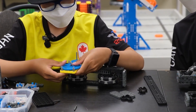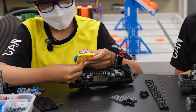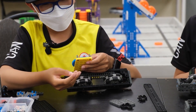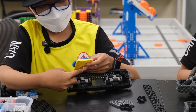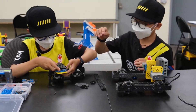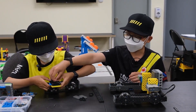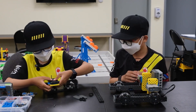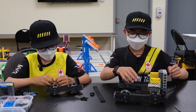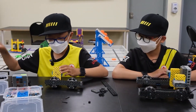For this build we are using the metal motor axles, but V1 comes with plastic ones. The plastic tends to break easier, that's why we got these metal ones instead. When you're done, the first thing we suggest is to change your plastic axles into metal ones because they're stronger. When you get heavy and add more stuff onto the robot there's more stress on the axle. Now I'm going to put the motor on.